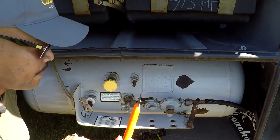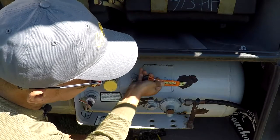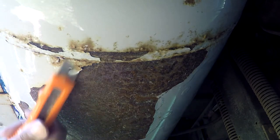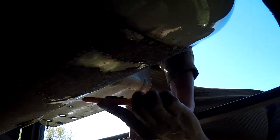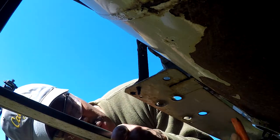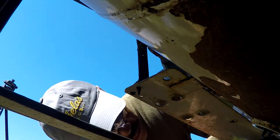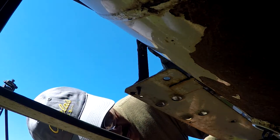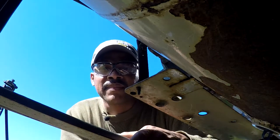I'm going to use my dull razor blade to chip away at any pieces of paint that are just residue. I'll continue taking this paint off. As you can see, I'm removing the old paint just by using the end of the blade. I'm removing all the loose paint droppings — not doing any major scraping. You just get the loose paint off, that's all. You're not trying to sand down or grind the whole thing.